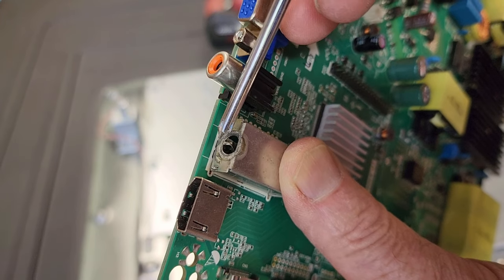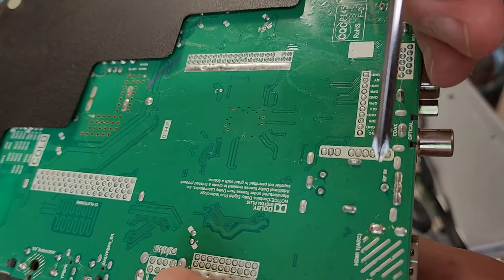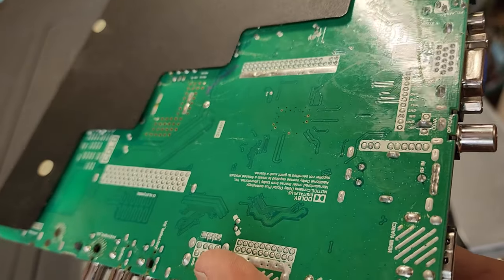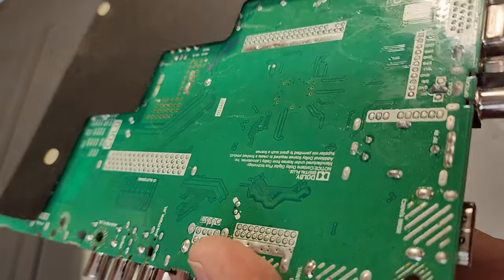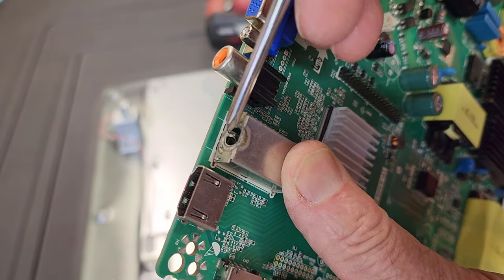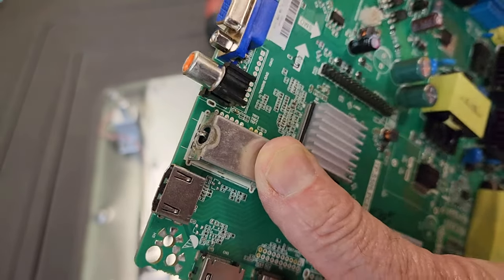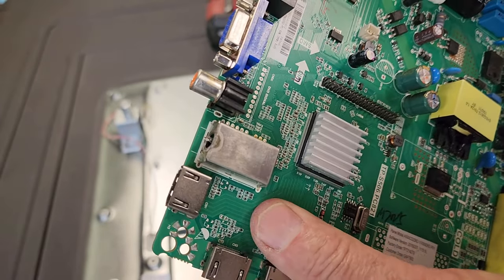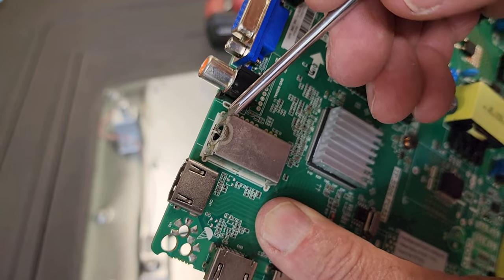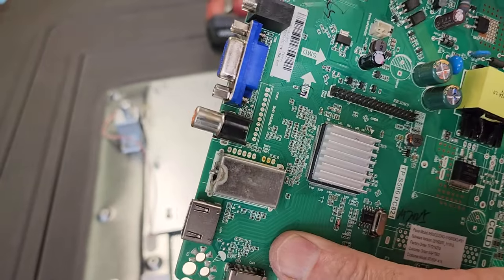The middle pin to the antenna just goes to that tab, which solders down to that terminal there. So it's not very complicated — there are no other parts involved. If I actually had a socket I could nearly solder the center tab and the outside to the can without even taking it off, but I think I'll have a look and see what I've got on other boards first. It'll probably be nicer to replace the whole can if I can find one the same, so I'll have a look through my stocks.